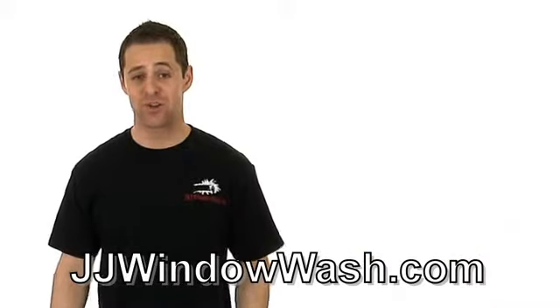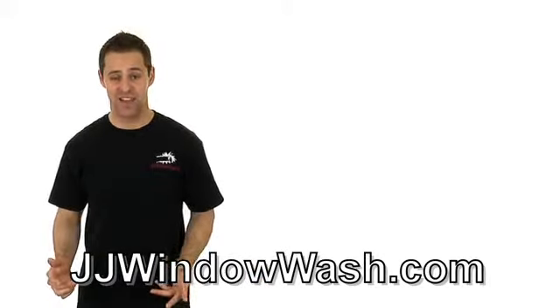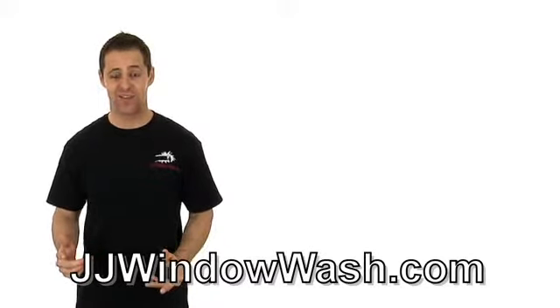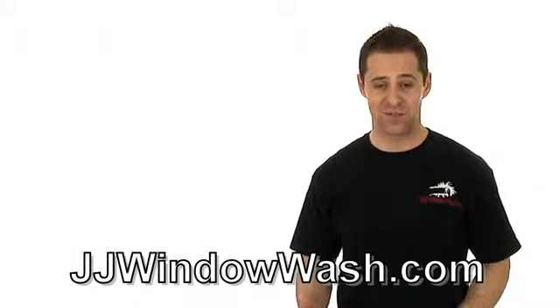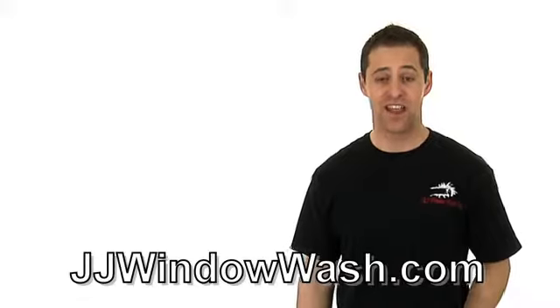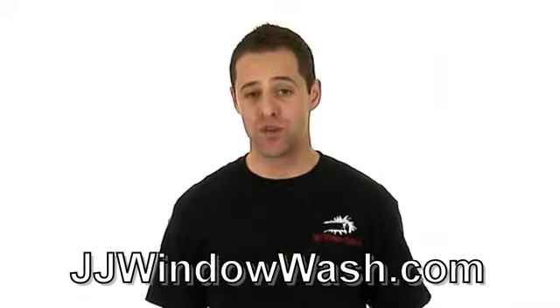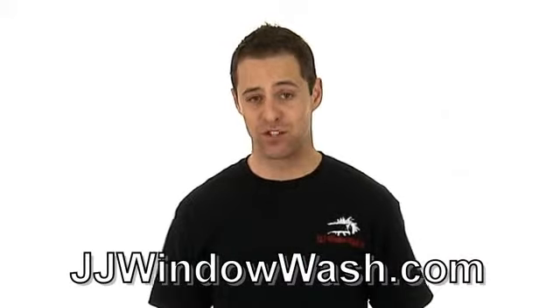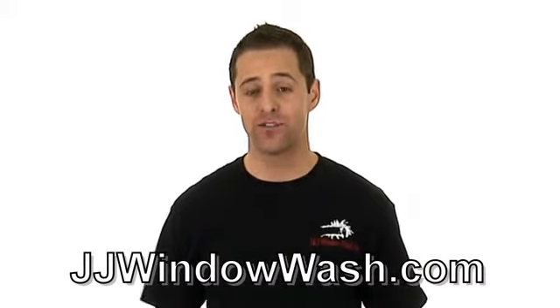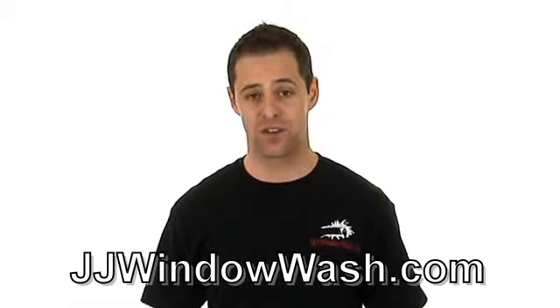So if you're going to pressure wash your own driveway and you find that your power washer has five different tips — each of those tips does different things. The black one is what you need for getting the degreaser on your driveway. The yellow one is for general power washing. The green one will do high power pressure washing. The red one I would not use because it would dig a hole in your concrete. The black tip allows a lot of water flow — very low pressure — but you don't need a lot of pressure when you're putting the degreaser onto the concrete.